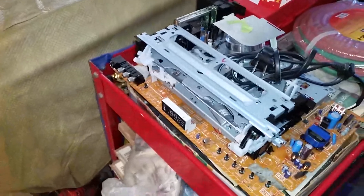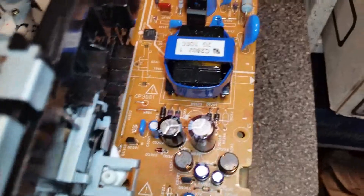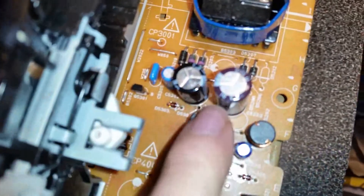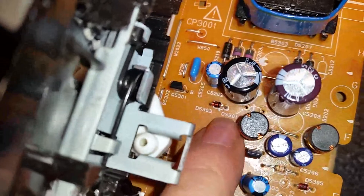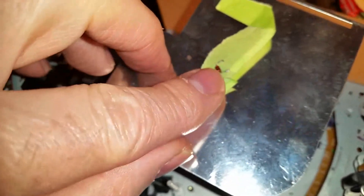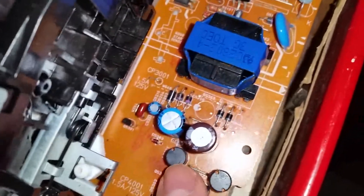Here's one VCR and there's the other VCR. This is the 2902, and this is the 2901. I identified the MOSFET was shorted on this unit. The Zener right there, D5301, which is right here, was shorted. And the same thing on this VCR — same Zener, shorted.